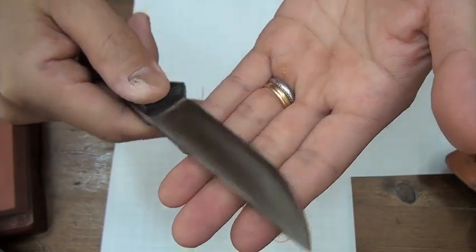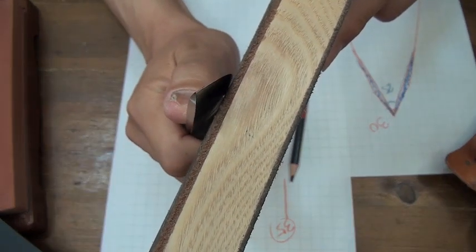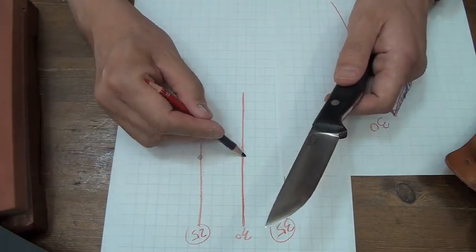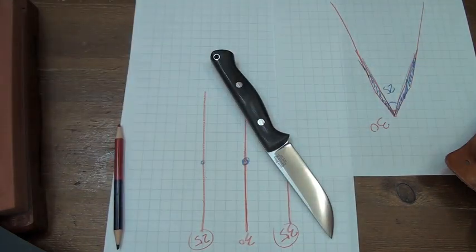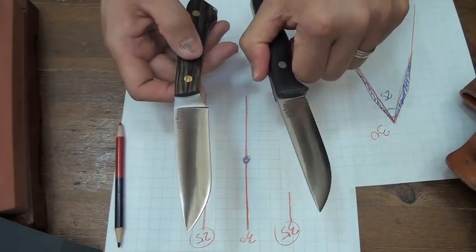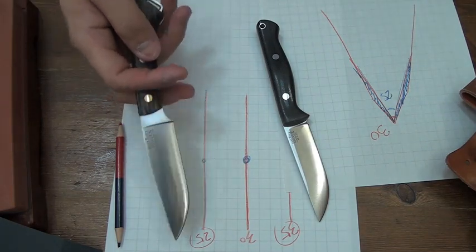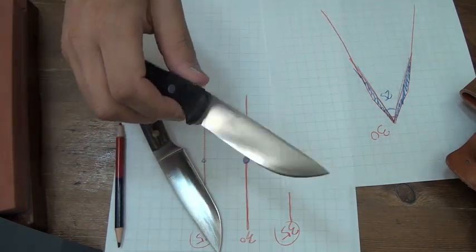So I put a microbevel on it - stropped at a relatively high angle, a bit higher than regular angle, and made it a deeper angle. Now in my estimation it has 30 degrees - 30 degrees, okay, it's sharp enough. The Bravo - sorry, it's A2. Stropping angle is different, intuitionally I know it's A2, so my stropping is 25 degrees this time. For the Sandvik, intuitionally I change my stropping.